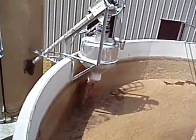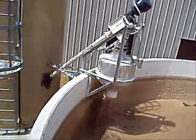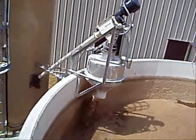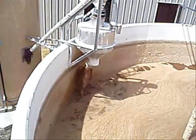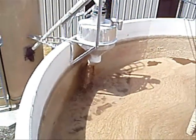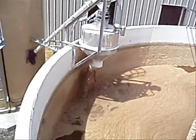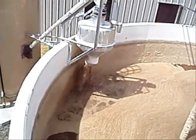You can even see a slight color change of the sludge. After the lime is added, pH analysis is performed to determine if there was adequate lime addition. pH sampling is done initially after 2 hours and after an additional 22 hours, for a total of 24 hours of lime hold time.